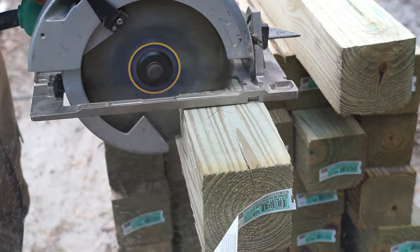I'm going to use a ratchet strap just to pull the fence tight, and then once I get it somewhat tight, I'll be able to take a 1/4-inch pneumatic stapler. And I'm using galvanized staples, so I think they were 1/4 inch by 1 inch, and using those to just staple the fence portion to the wood post.